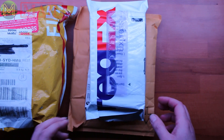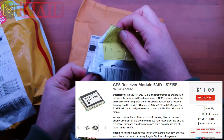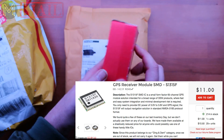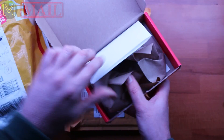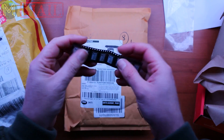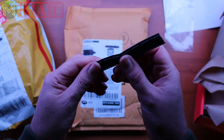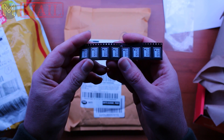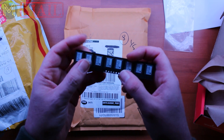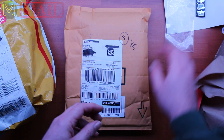The first one comes from SparkFun. There were a couple of ding-and-dent items from SparkFun that I wanted to get, and the reason being is that they were fairly cheap. These are small SMD GPS modules, and I bought about eight of them. They support 65 channels, 10 hertz refresh rate, about a 30 second cold start, and one second hot start. These cost me 11 bucks US — pretty good. You can never have too many GPS modules.